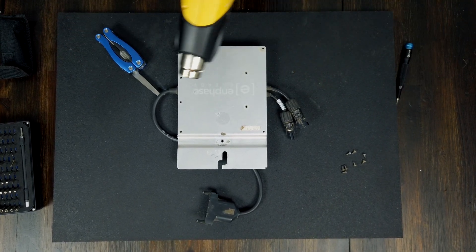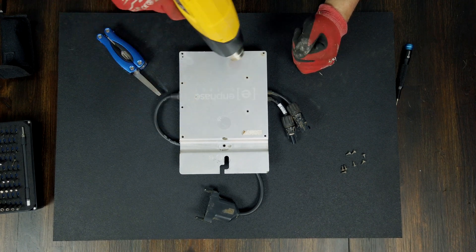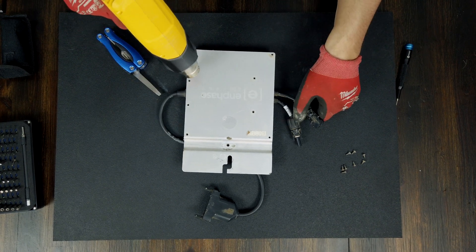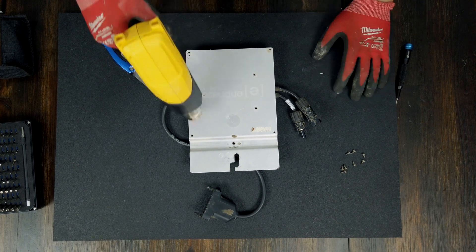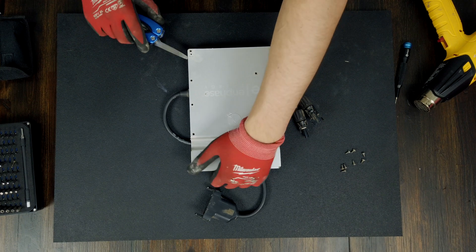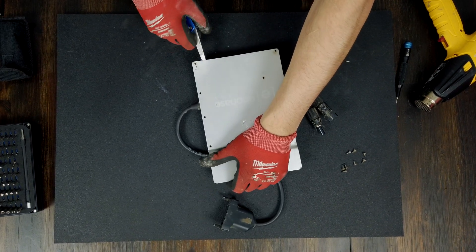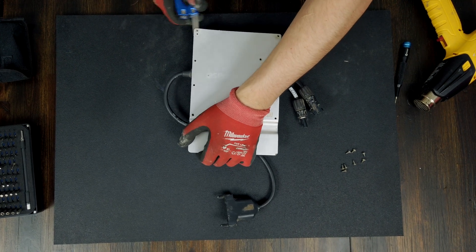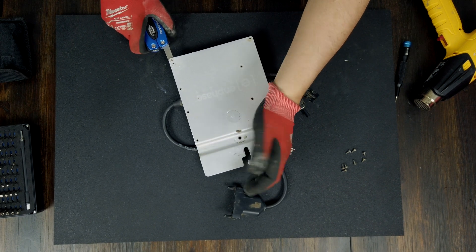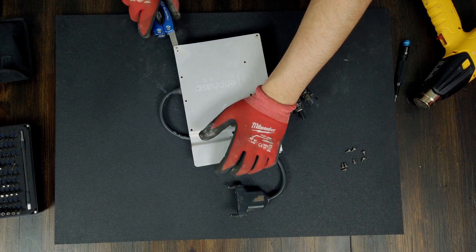It's going to be a little disappointing, but I still want to get into it and find out for sure. While I'm heating this up to keep prying, I want to talk about microinverter advantages. Enphase's biggest competitor is SolarEdge, which uses optimizers with a central inverter. There are advantages to SolarEdge's approach, specifically when looking at batteries or an EV charger, because their new energy hub inverter uses Prisma technology for DC-to-DC power.